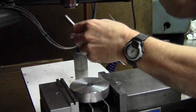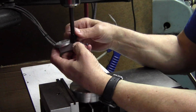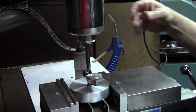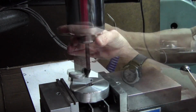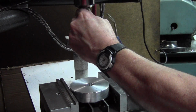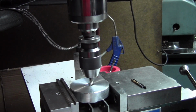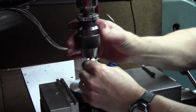Now we're over on the Bridgeport and getting ready to indicate in the center. Get ready to use the digital for the bolt pattern on there. I'll be using the digital readout bolt circle function to put in the 6-hole bolt pattern. But first I'm doing the 2 M5 tapped holes that are for the screws that actually supply the driving torque.